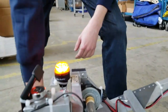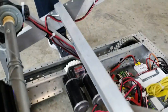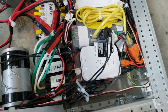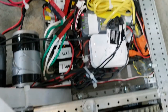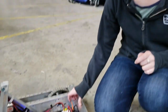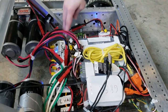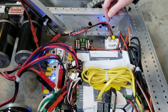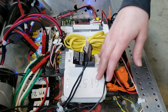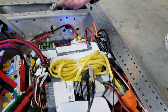All of this is provided by our battery, which is back here connected by this strap. Here's all of our electronics — everything's in here, there's some stuff under here that you can get at relatively easily, and we've checked it with the rules and we think it's adequate. On the electronics board we have four Victor SPs which control the drive motors and they're PWM controlled, as well as four Spark motor controllers, which we're only using three of right now, also PWM controlled. Up here's the RoboRIO and the radio — the radio gets powered through the ethernet. And below this, on a little platform, is the PDP.